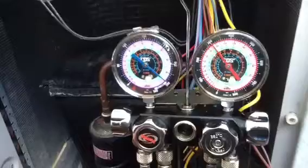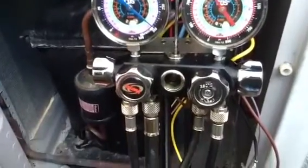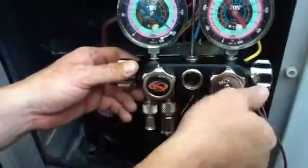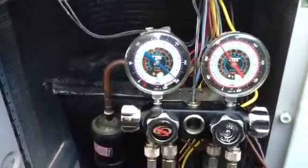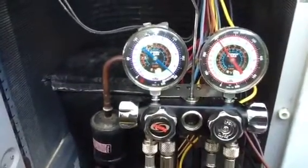These are the vortex gauges, by the way. They have four ports on them — they're great. It actually has a half-inch hose to pull a deeper vacuum. That's the next step; he'll pull a vacuum on this thing, pulling it down to about 200 microns.